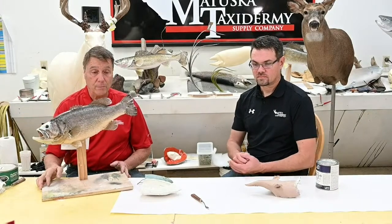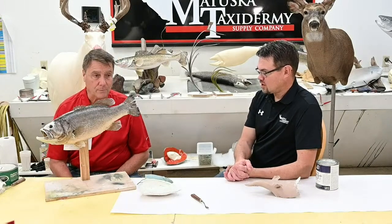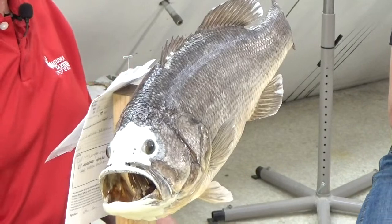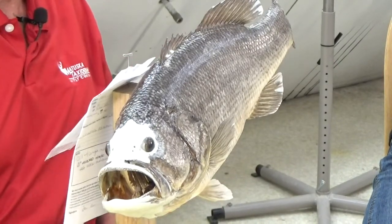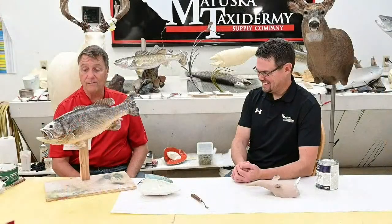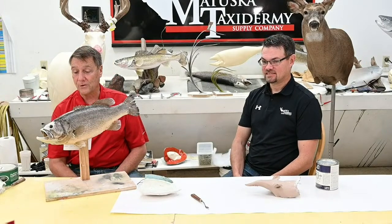There's a lot of good rebuilding epoxies. There's fix-it sculpt, there's epoxy sculpt, there's clay, there's magic sculpt and all kinds of different sculpting materials, and they all have different attributes. Some of them feather out really, really easy. Some of them mix really easy. We used to have some in the old days that by the time I got A and B mixed together, my fingers were so sore I couldn't feather it anymore. PC7, we used to use PC7, which is kind of a marine epoxy. Some people still use that.